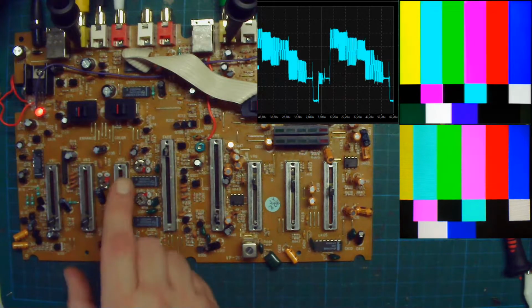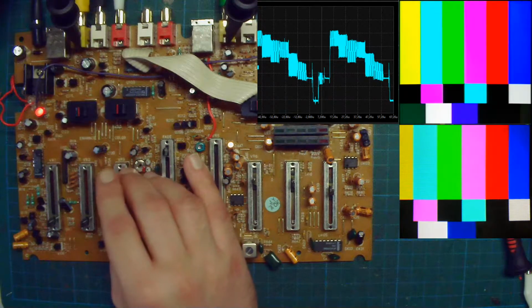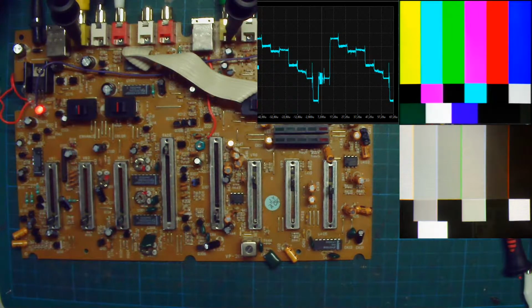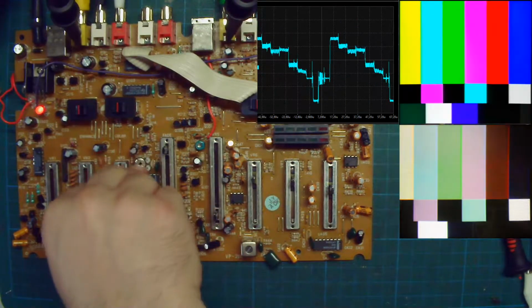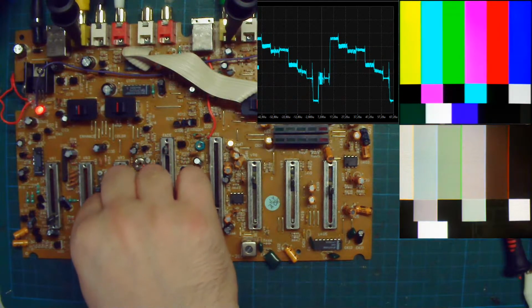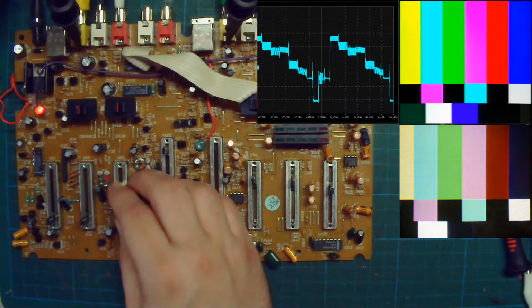Basically, if I cut the color here, you can see that it acts on the signal. I cut it completely. As you can see, the TV on the bottom is almost black and white, but there's still a bit of color, mostly at the transients. Those filters usually don't cut color really well, and you can see the capture card at the top doesn't react to the color saturation. Maybe because inside it amplifies the signal a lot in case the signal is poor. So yeah, this acts on the color saturation.